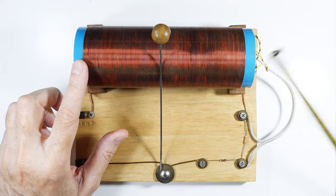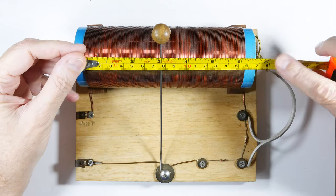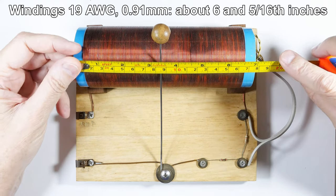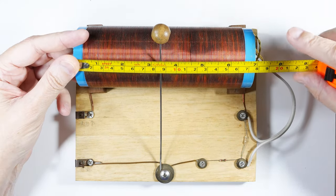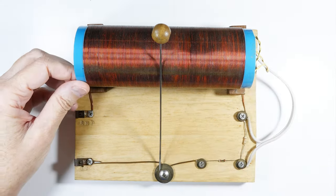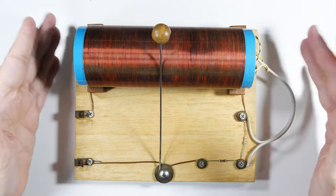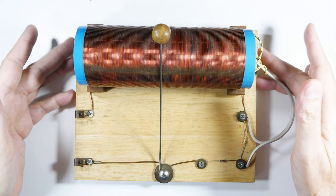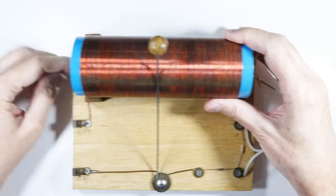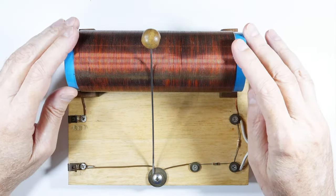Using the 19 wire gauge, our winding is about 156 millimeters long. We're going to use a form that is 176 millimeters — so this length of pipe is 176 millimeters. We're going to want our base to be a little bit bigger than that for mounting purposes, so there's a little extra on each side. How much extra is up to you, and that's why we're doing the winding first.